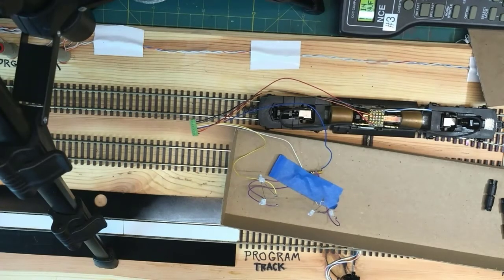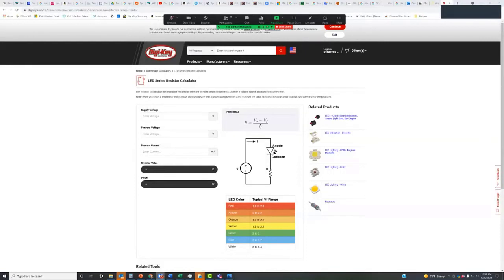But Phil, you'll actually get the same brightness if you simply adjust the resistor to maintain the same current through those two or three or four or five LEDs. I could have, and probably should have, now that you pointed it out to me, wired the two headlight LEDs in series and simplified my wiring. And so thank you for pointing that out to me. That's my learning from this tutorial.